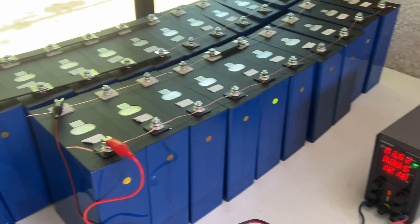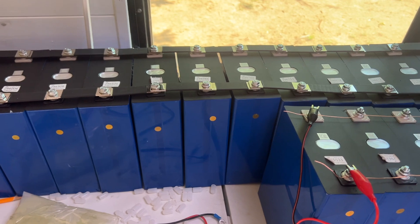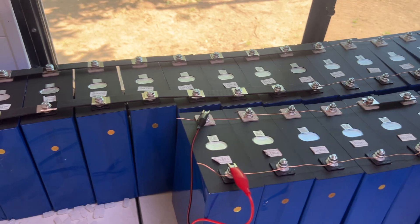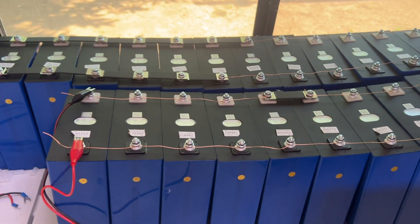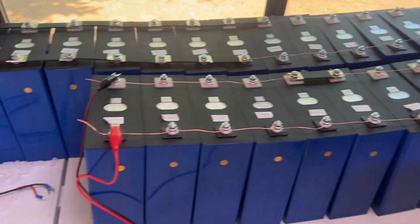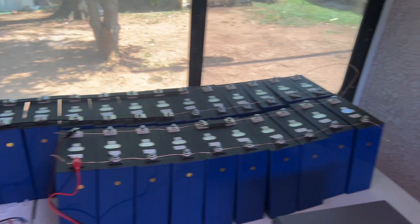If you haven't seen the past video on the battery, how I hooked them up — they're all in parallel. All the positives, which is the black wire. Remember, black on a battery like this is the positive, because they are modeled after house voltage. In house voltage, the black is hot, and then the white is the negative. So what I've done is hooked all of the positives together, all of the negatives together, and hooked them into my charger. That's how they are being top balanced — all in parallel.